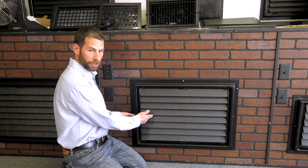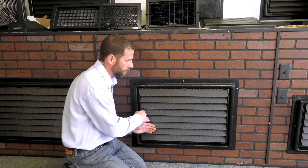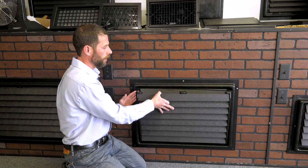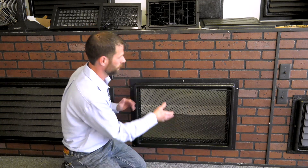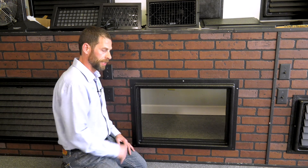It's a fixed louvered flood vent. Again, you can still access your crawl space once your frame is mounted. You undo your nut if you're using them, then just pull your pin on the left and right side. You remove your vent system and your screen, and you can still access your crawl space.